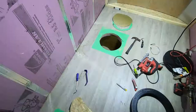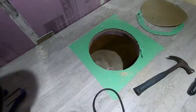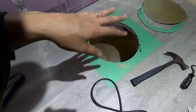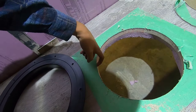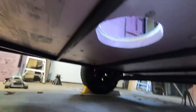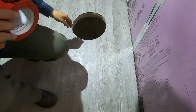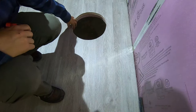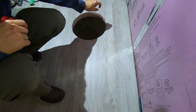I got the hole cut — that was actually relatively painless. Now I'm just going to clean it up and install the flange. I'll pre-drill all the holes through the floor so that the screws don't crack the flooring. I'm going to add a bead of caulking around it just to keep that nice and sealed so no water gets in between the floor and the subfloor. I decided I'm also going to install some tuck tape to seal the exposed edges, just to avoid water getting in between the floor and the wood, because it is kind of against the grain. I imagine if water got in there it would absorb, and whether I like it or not, this will get wet — so just a precaution.